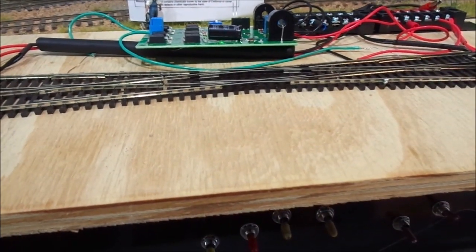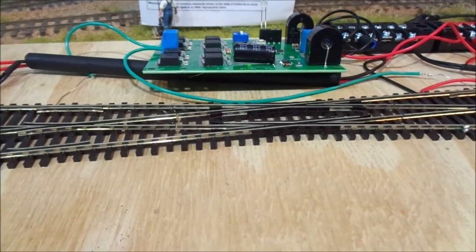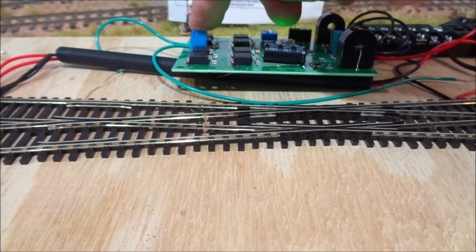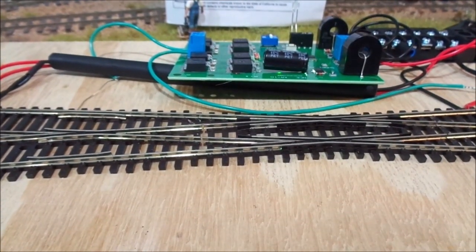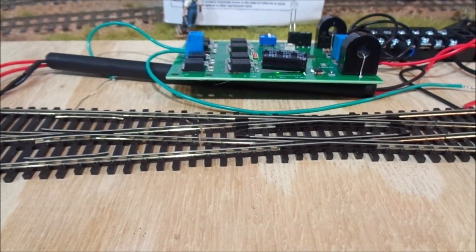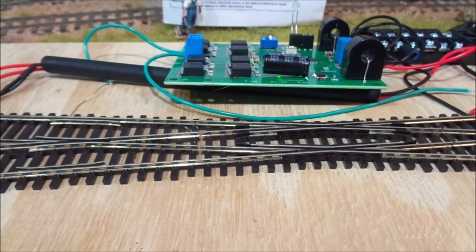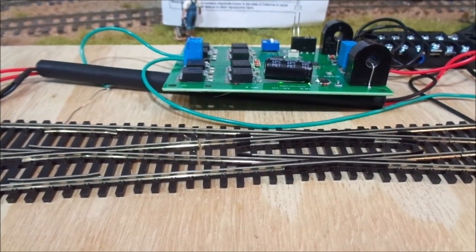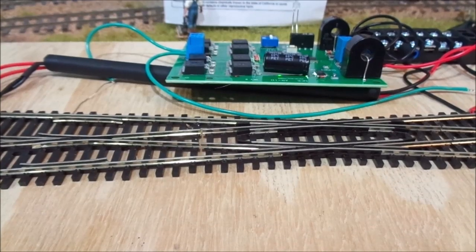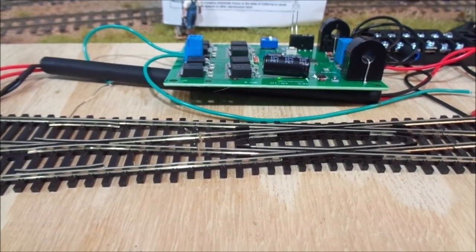What I found important is that the connection — the wires going into the tabs — they need to be a nice big piece of wire so that the connection is good. Not just a little end tinned. I bend the wire back and double it, so I get a good surface contact.